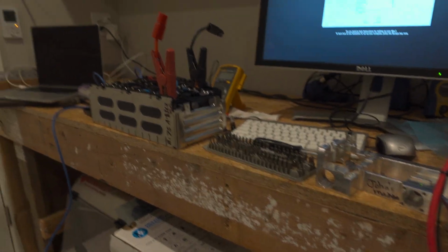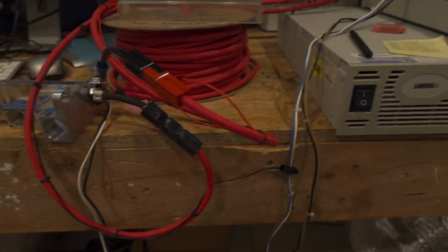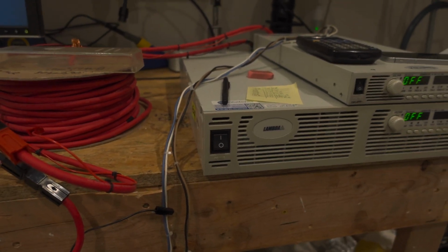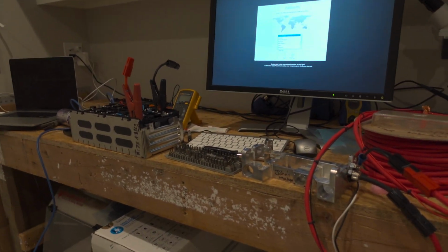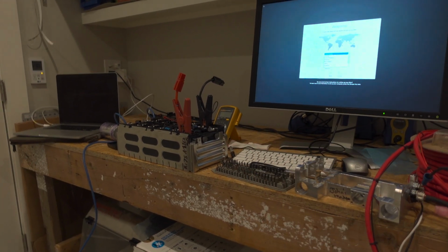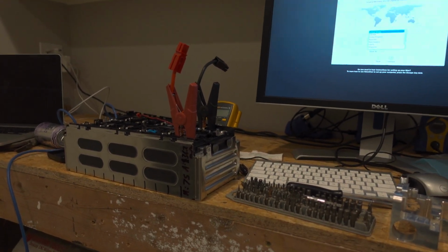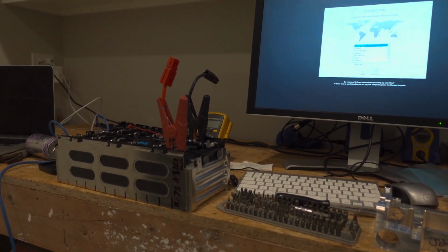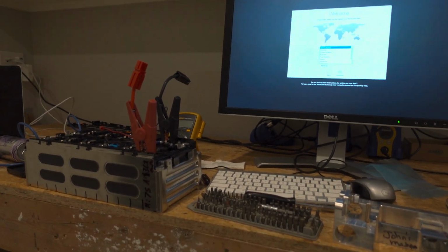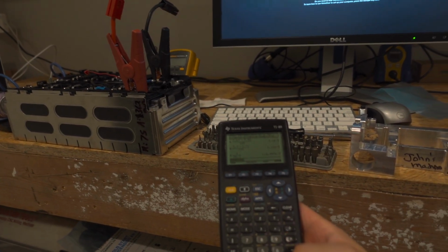The next video will probably be it actually running, once I whip together a quick LabVIEW program. And of course, the reason I'm doing all of this right now is, one, to procrastinate so I don't have to work on firmware, but two, this test is going to take several months to get useful data for every cell that we test, unless we just thrash a cell. For example, if this cell only lasts 100 cycles in this first test, which I've written on the side and is the most extreme that it would be in an LIBCM car, at least for now, with the plus 40% current hack. If we can get the current higher later, then it might abuse the cells more. But if this lasts 600 cycles and we can do 21 tests per day, so it's 600 cycles divided by 21. I don't do math in my head, but it would actually take almost a month to get that data.